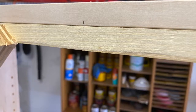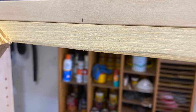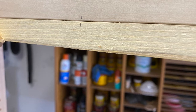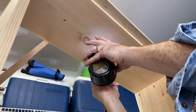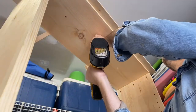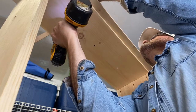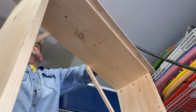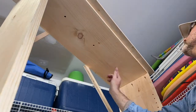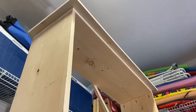When I mount the top to really anything — tables or otherwise — I always just mark the centers and the sides and then line up my lines. Works perfect every time to get something centered. I'm showing you that here with this still shot. Next I was attaching the top, just by drilling some holes and putting some screws in. I did plug these screws and also tacked it from the top with a little bit of glue — just didn't want that thing moving at all. Here I am plugging those; they sanded down nice and smooth and made for a nice finish.